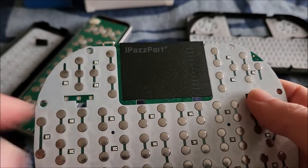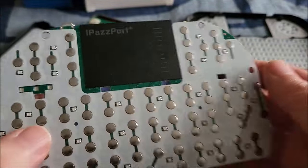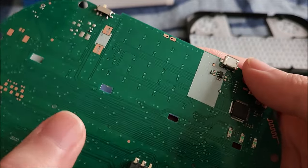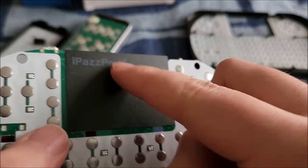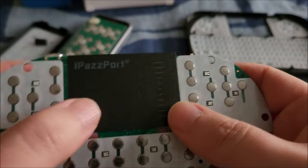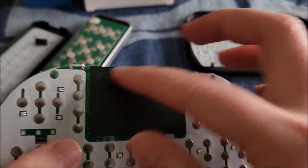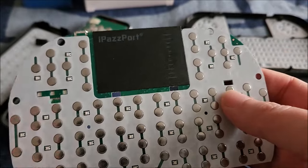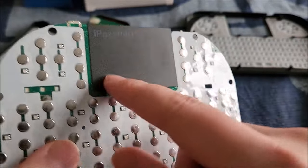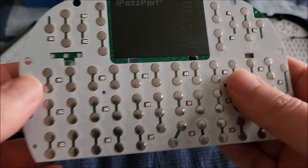On the front we have all the LEDs diffused by the silicone membrane. I love their implementation of the trackpad — it's just on the PCB itself. You can see all the vias going to the other side. I'm not going to peel it off because it'll never go back on nicely, but you can imagine there's probably a matrix of row-and-column pads, and that's how it determines finger position — it's all capacitive. If I ever get one that breaks, I'll definitely peel one up to see exactly what's under it, because I'd like to design my own capacitive touchpads. Everything else is buttons all the way down.